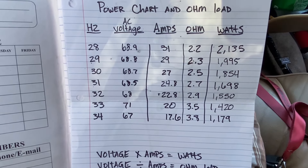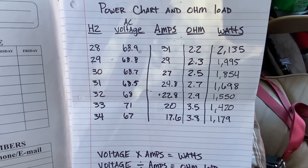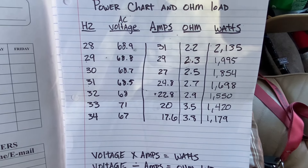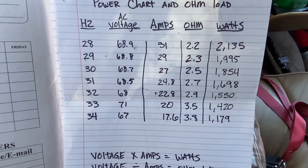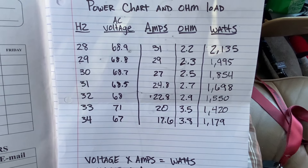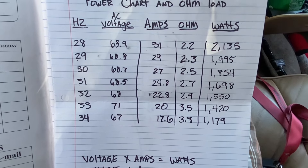This is on a 370 amp alternator with just one AGM battery — basically no reserve at all, just one single AGM. So that's what it is. I told y'all it wasn't that much. I had a couple people thinking it was 3,000 or 4,000 watts — it's 2,135 watts. And right at tuning — tuning is at 30 hertz — it was clamping 1,800 watts at 2.5 ohms.